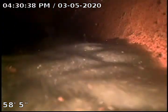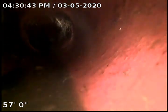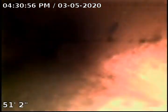Did try and work it with the big machine. Here we start getting to the point — we've got the K60 rolling. There's a belly here, and we did run a lot of water too. You can see I did quite a bit of cleaning up. There were some roots, like this one on the top right, that I just could not get clean — I sat there and worked it for a while, they're just too thick. But the majority of these were pretty close, from about 70% to almost 100% clear, enough just to get the camera through. So I think we did a pretty darn good job here.